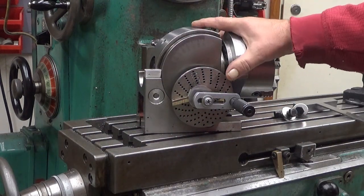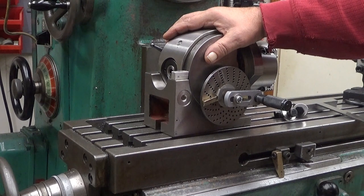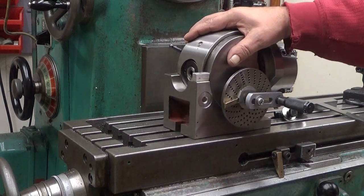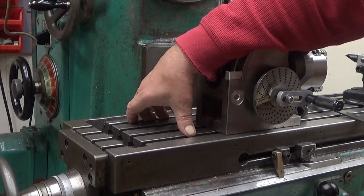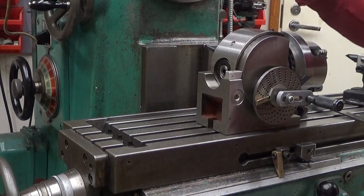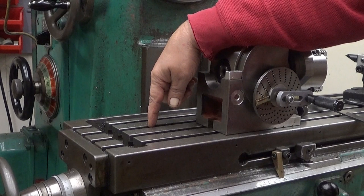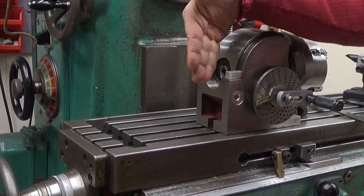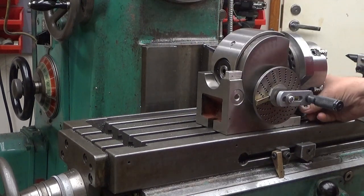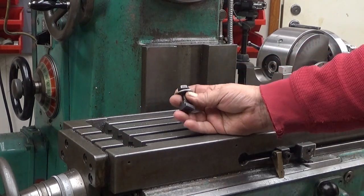Now, before we can attach any workpiece here, we need, of course, to attach this one to the milling table. Well, that's easy enough. Well, first of all, I have chosen, I have four grooves here. When I aligned the cutter, I was looking at this groove, so that it's above this groove, so that I can align it easily there. So that will be our center point.